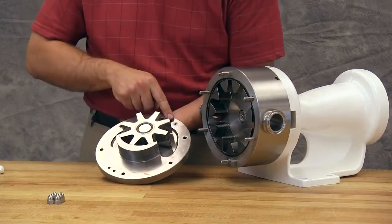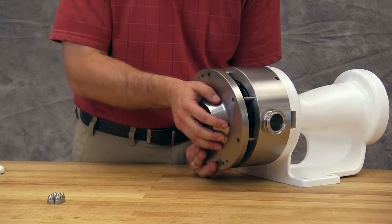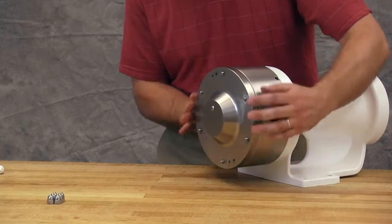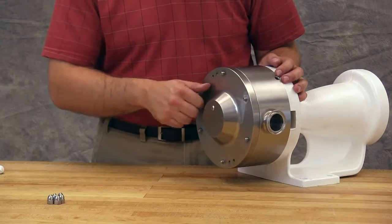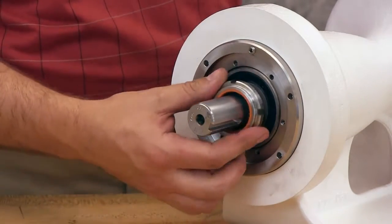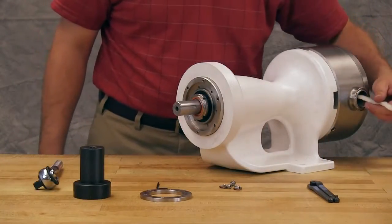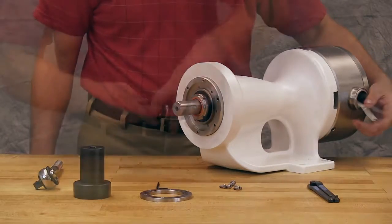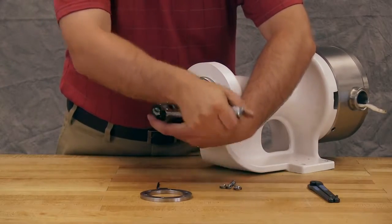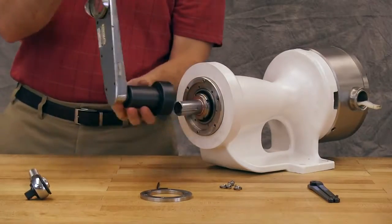Install the head onto the casing using the head alignment pins. Secure with the head nuts. If your pump has a mechanical seal, reassemble the casing, rotor, and head without the seal installed before tightening the lock nut and setting the end clearance. Insert the plastic bar between the rotor teeth to prevent the shaft from turning. For O-ring seals, the lock nut can be tightened while the seal is installed. Using the lock nut wrench, torque the lock nut to the appropriate value as shown in the TSM.